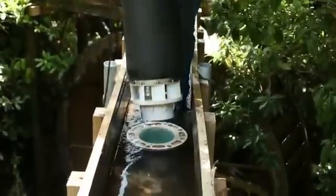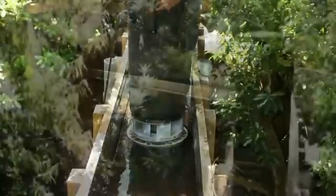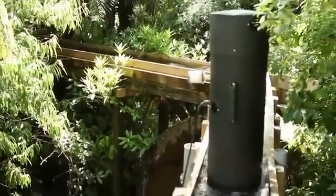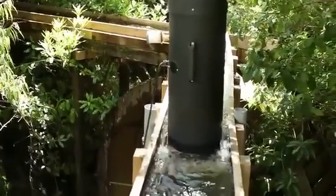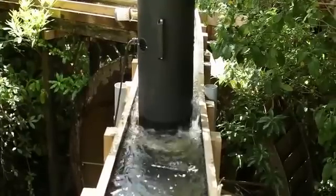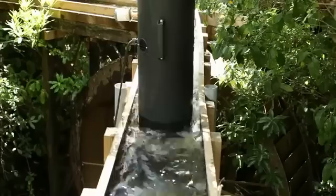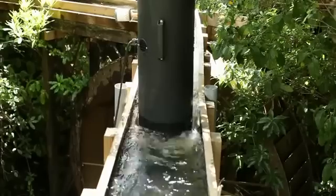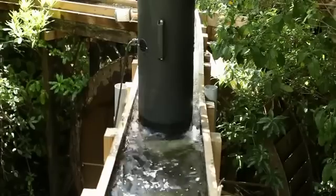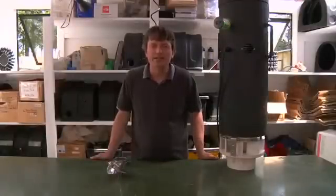It's a low-head hydro turbine that replaces a water wheel. Like our popular Pelton turbine PowerSpout product that has sold all over the world, the PowerSpout LH incorporates modern quality materials. It is nearly 100% made from plastic, stainless steel and aluminium. We believe that the parts in a PowerSpout LH are durable and will last in excess of 10 years between major overhauls.